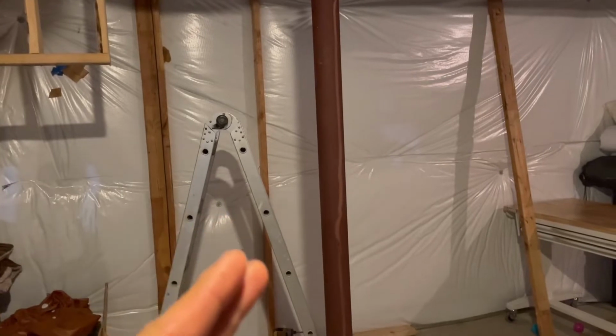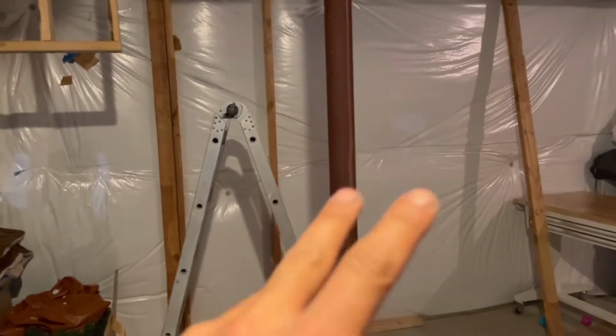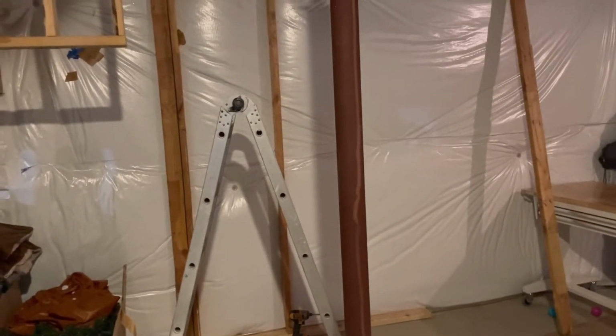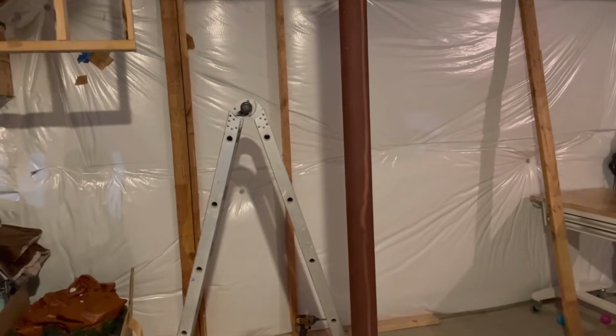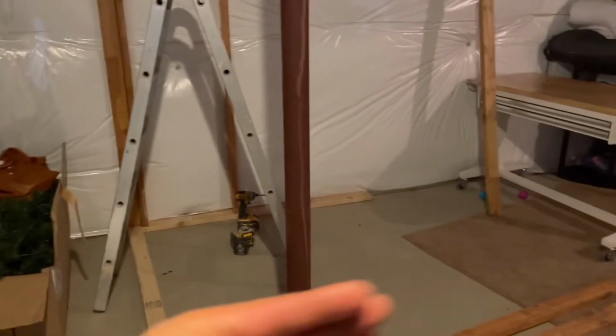As of now, I'm just going to go with my layout. I'm going to go every 2 feet at the back wall. Behind that wall is a concrete wall, so I'm not really worried. I'm not trying to go with a 16-inch layout. I will, however, on these walls and the door.